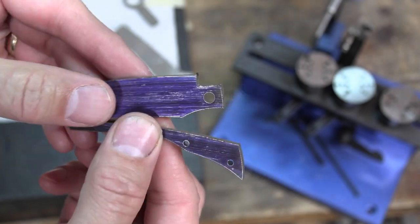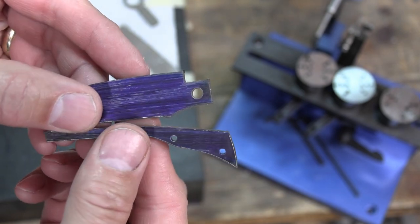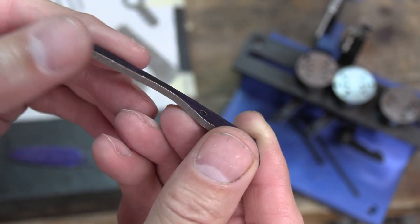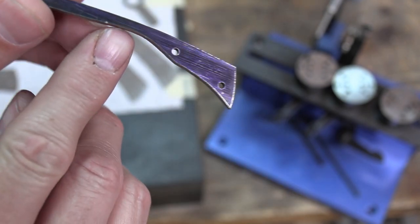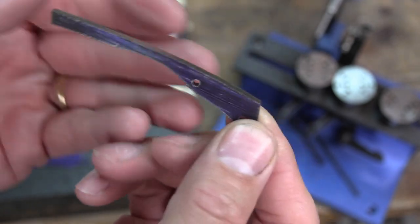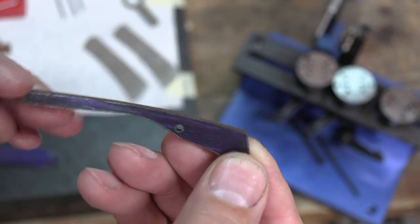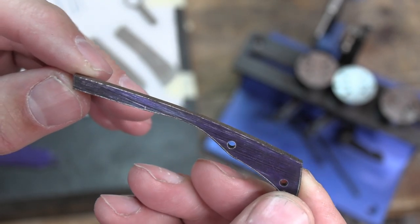The first thing I'm going to do is a little work on my spring. I always finish out the bottom side — I might take it to like a 400 grit and then use my wheel on my horizontal to clean up the inside right here. I make my spring and pretty much finish the bottom part before I move on to working on the blade. Let me do that and then we'll move on to the blade.